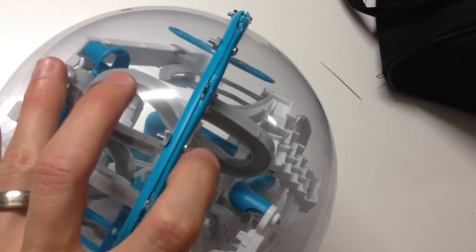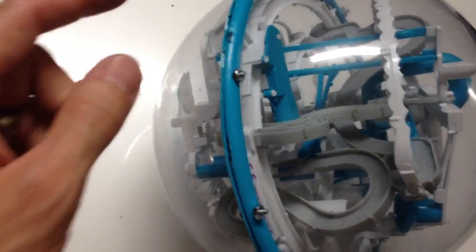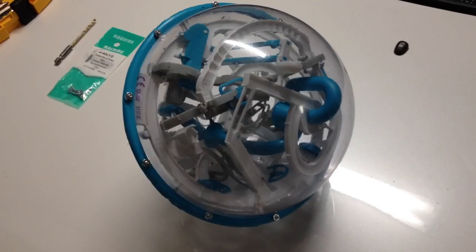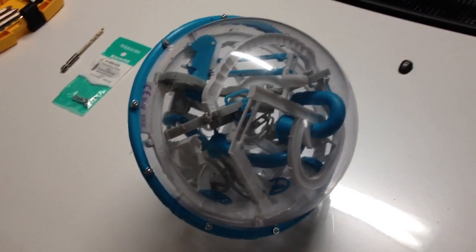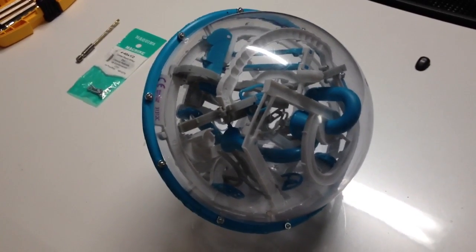And then what I had to do is I would just hold on to the nut right here on one end while I ran my drill on the other end so that they went on real fast. I was picturing myself having to sit here ratcheting these down, taking forever to do it, but it was really simple. In fact, once I had all the bolts through the holes, I had the nuts on in probably 5 minutes. The whole repair, taking it apart, gluing it, drilling the holes, and putting it all back together took me about an hour.